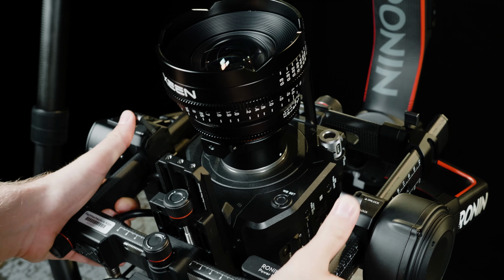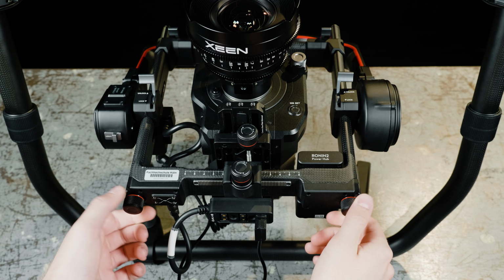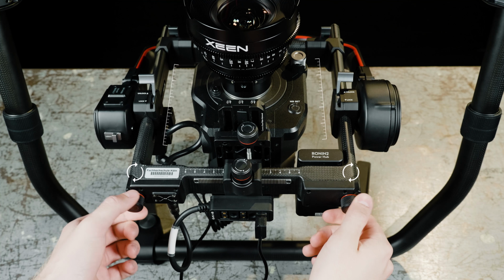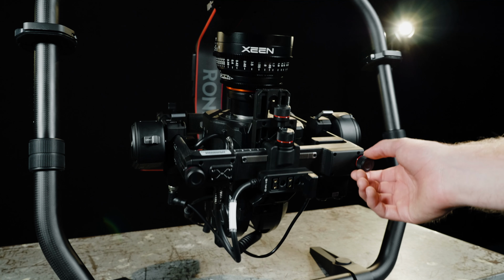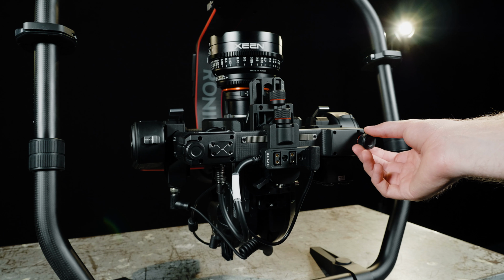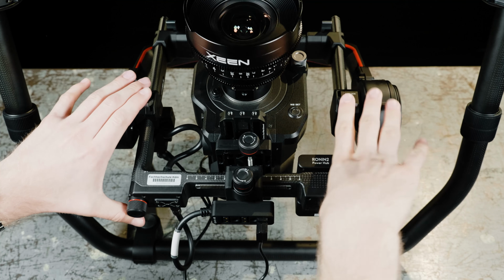Loosen the levers on the sides of the camera's fixing frame. Use the knobs at the bottom to adjust the vertical tilt balance and be careful that the tick marks on both sides match up. When balancing, it is important to work with millimeter precision. The camera should now stay balanced without tilting up or down. Tighten the levers.